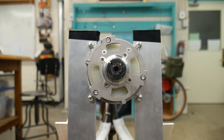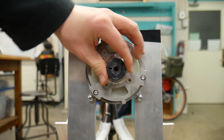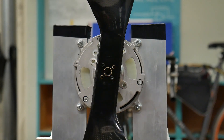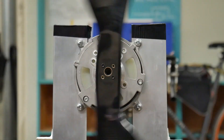With that done, I needed to figure out how to mount the propeller on there. The answer came from McMaster, as it seemingly always does, in the form of a 13mm shaft collar. Combined with some 3D printed parts and a CNC mill, I was able to create a perfect part to mount the propeller to the motor securely, because it needed to withstand all the torques of the motor firing up.